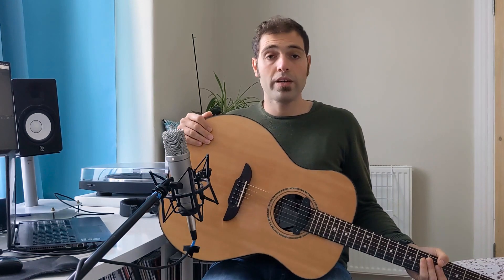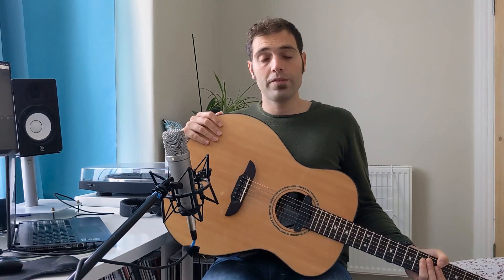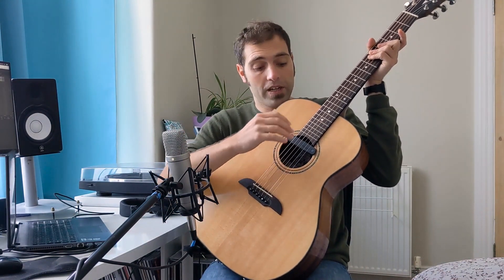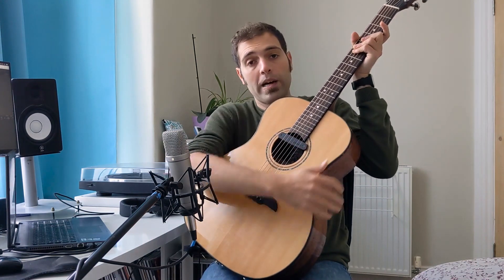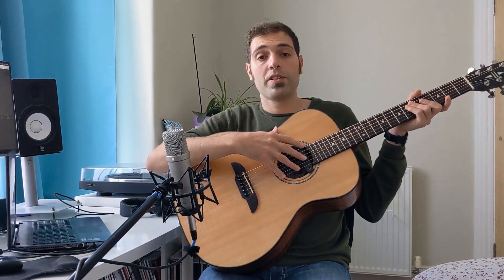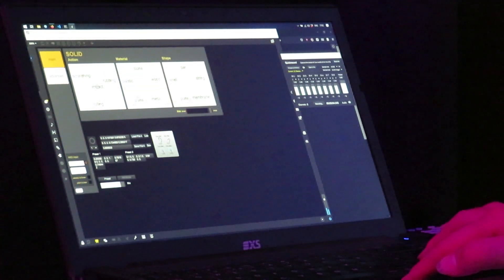In the spirit of augmented instruments, we wanted to keep the Hitar as close as possible to a regular acoustic guitar. So we took a concert-sized steel string guitar and put five sensors in the three zones most widely used in percussive fingerstyle: at the sound hole, at the upper bout, and at the lower bout. The sound from these sensors is processed by Prism Lab's Metasynth, a synthesis engine capable of recreating several materials, shapes, and sizes. It can also morph between them with a graphical user interface working in real time.